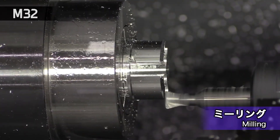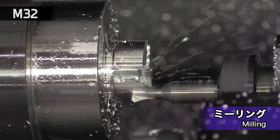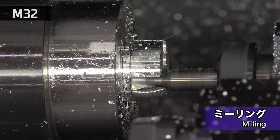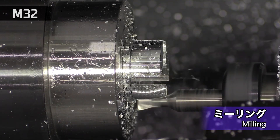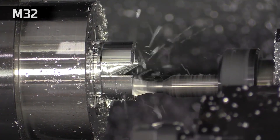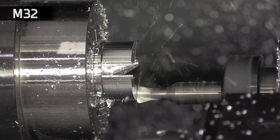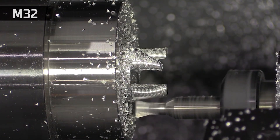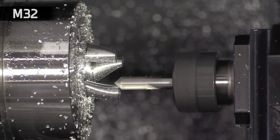The power of the revolving tool drives on the turret is doubled. The main spindles and sub spindle power have been increased. Something to note as well: the motors on the machine are servo driven, not spindle motors. Basically what that means is you've got the maximum amount of torque from low range to high range — you haven't got to wait for the RPM to rev up to get the torque. So you're going to make complex parts on tricky materials.